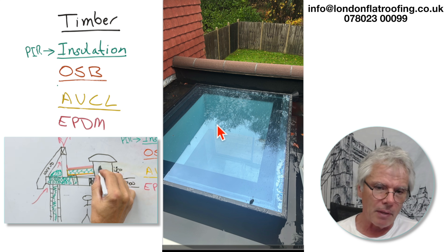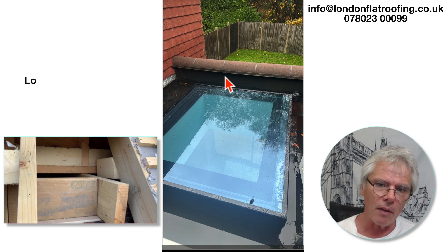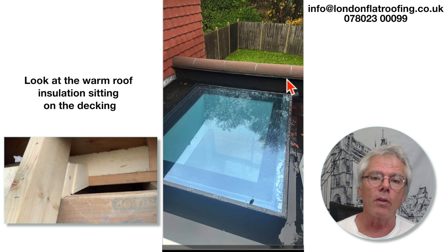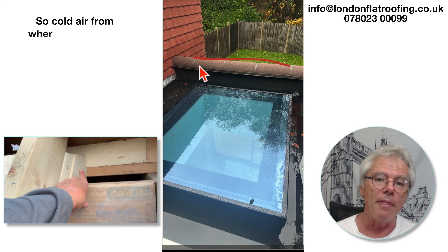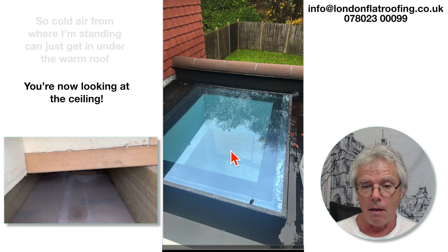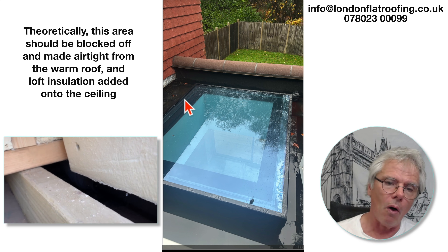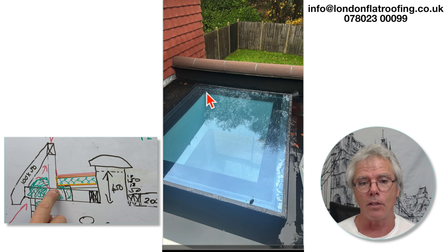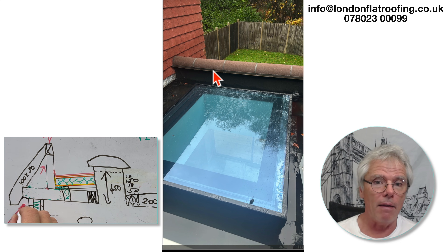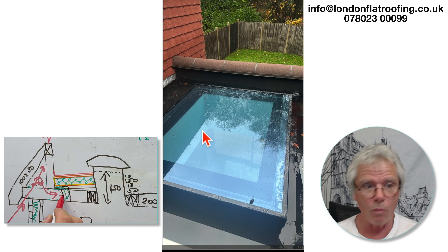You can see the kind of information you can get from a picture. Building this is highly complicated — where do you stop the warm roof? As it runs underneath this area, all of that over here will be a cold roof construction. Theoretically, on the other side there should be venting running across the top and down on the soffit boards so that air can circulate. Remember, inside underneath this is a liveable dwelling, so the thermal insulation would be at ceiling level here, but much higher on the warm roof side. How the two join together is really complicated to do correctly — in fact I don't think I've ever seen it done correctly. What normally happens is the cold air, if the venting has been put in correctly, circulates underneath the warm roof and therefore the warm roof doesn't work.